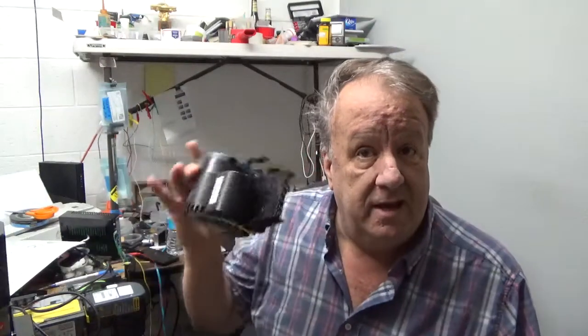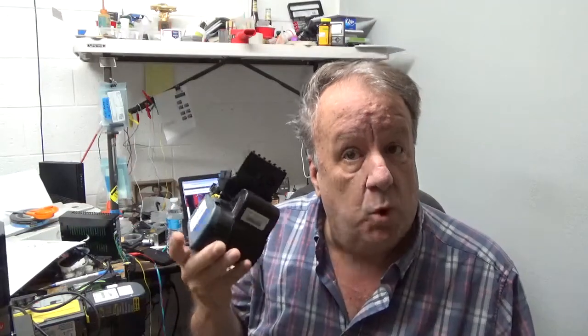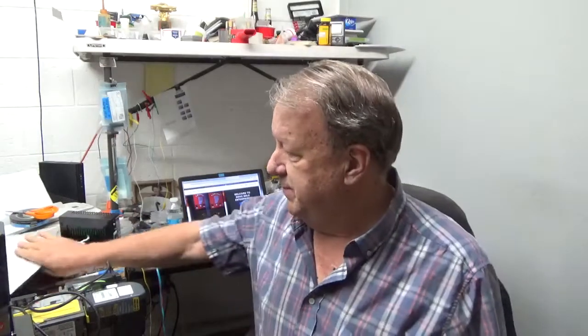Kind of exciting for me, as well as hopefully some of the other ones. Working with recyclers pretty much all week. It takes a while to become really proficient with these, as there is a lot to do with categories, setup, subtitles. I've printed out the four most important pages as far as codes, how to load them, unload them, that's kind of the easy part, how to set the bill denominations, whether you're going to recycle ones or fives, that's pretty much all anybody does, how to set the MDB level, which factory setting is 3, and that covers just about everything. Mostly people don't put recyclers on the older equipment that have the MDB level 2, but just in case you do, that is an option.